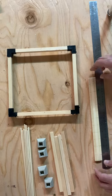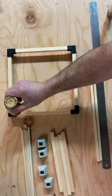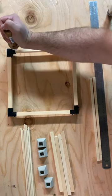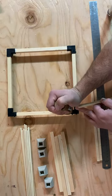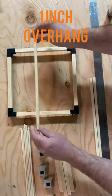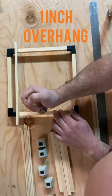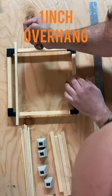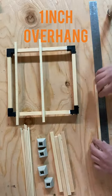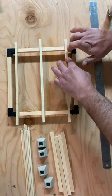With our cross beams ready, we're gonna go ahead and glue them on. Take those four-by-fours and line them up — one right against the three-way joint piece on each side, one on that five-inch mark, and one against the other three-way joint. You're looking for about an inch of overhang on each side. Doesn't have to be perfect, but about an inch on each side will give you a nice square look.